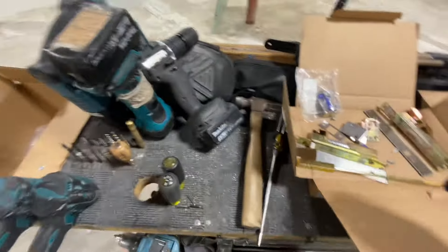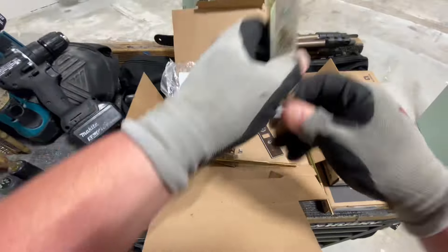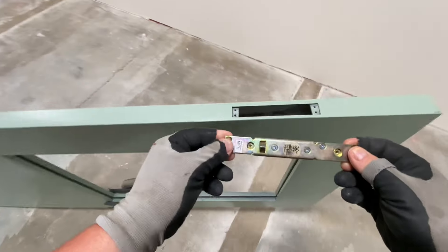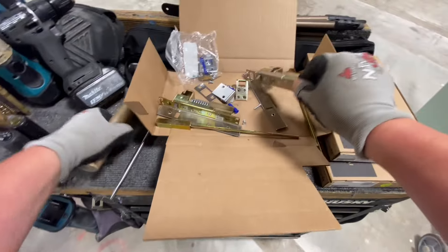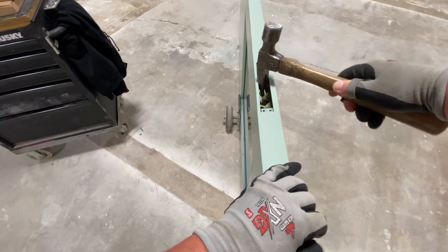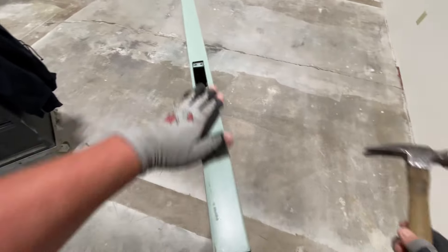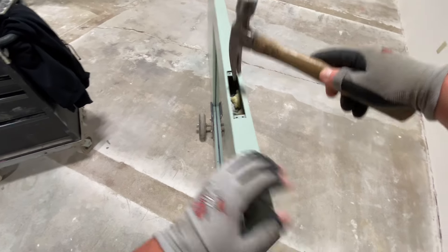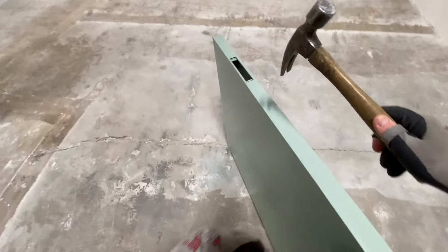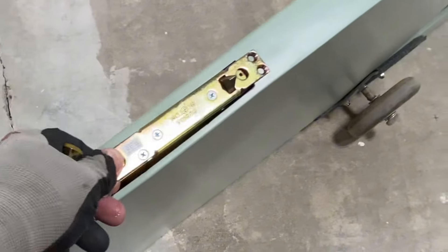These are really fun to install. I take a little bit of time to look at the prep in the door - that's really important. All doors are built differently and come a little different. I'm trying to dry fit it and I'm noticing the prep is a little tight, which is common. I'm going to spread the skin of that door just a little bit to give room for that flush bolt to sit in nicely. That's especially important on flush bolts that have a really thin metal cover plate - I see so many times those thin metal cover plates get messed up because people didn't take time to clean up the preps.